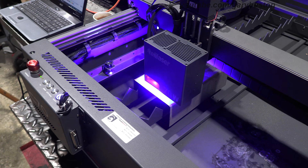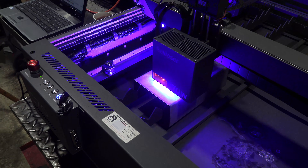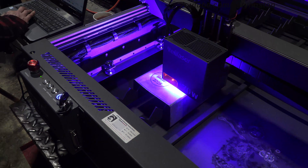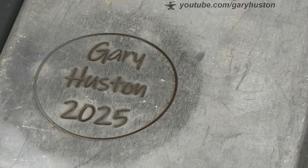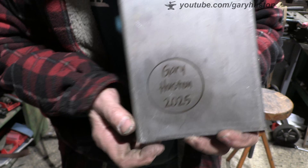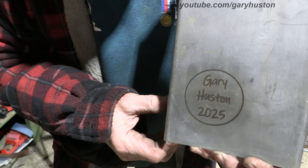Let's try a bit of engraving - this is engraving on stainless steel. All I've done is a test piece; I haven't done any actual engraving on this so this is a first. I just want to see what it can do. I think it's one mil - it might be 0.8 mil stainless. At 100% power - you can see the test piece I did above it. And that's engraved pretty deep - that's not going to come off or wear off; it's really deep. So go and check out the Kickstarter program, and we'll catch you on the next one.